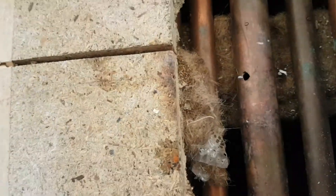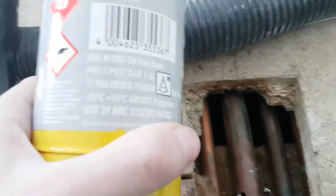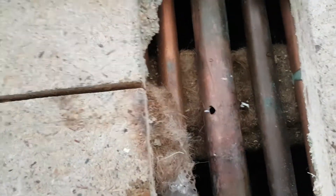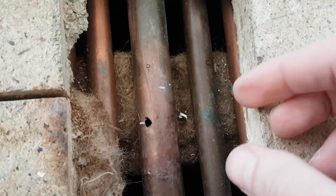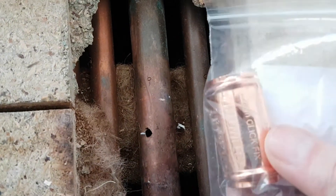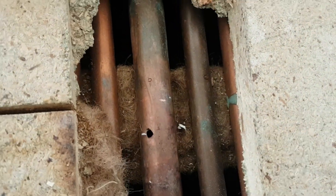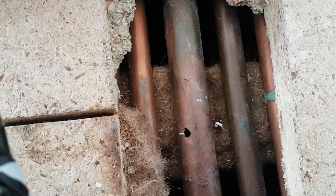For some extra insurance, instead of using a propane-butane mix, use map gas when it comes to soldering, as it burns hotter. Just warm up the pipe first and that will help evaporate any remaining water. The main issue is that you can't solder with water present. So with these three methods — hoover out what you can first, then syringe out as much as possible, then wick out whatever's left — and use map gas, and you should be able to deal with it.